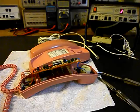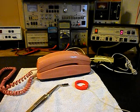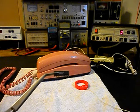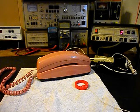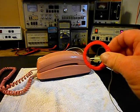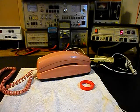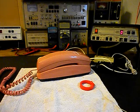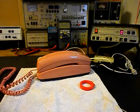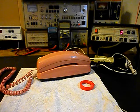We're back now and we are finished with the repair of this really cool Trimline telephone. We want to start our final checkout. We have our old IC and we can go ahead and throw that away - it is of no use to us. I also want to mention our amplified pickup, which we use in troubleshooting, repairing, and final checkouts. It's amplified so you can hear audio from the receiver. It has a button - when I press it I can give dial tone or take it away. Since it's an open amplifier it is prone to static interference or noise in the atmosphere.